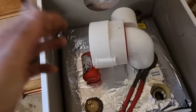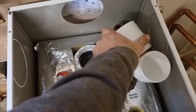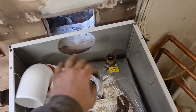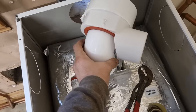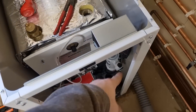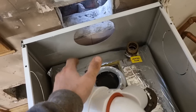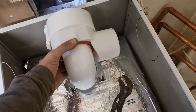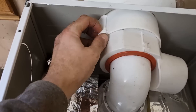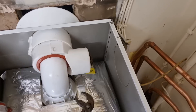If you want to go left or right with your flue, you can use the built-in option, which saves you buying an elbow. Unlike on a Worcester where you have to buy an elbow for about 58 quid to go out the right-hand side, this comes with everything you need — you just have to put more of it together yourself. That flue is all fitted now. It's got a clamp so the air intake doesn't go all the way through, sealing it properly. Next job is flow and return.